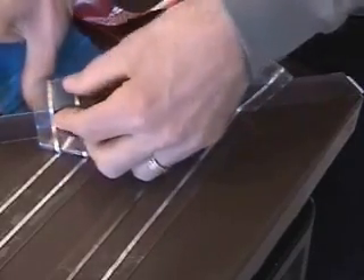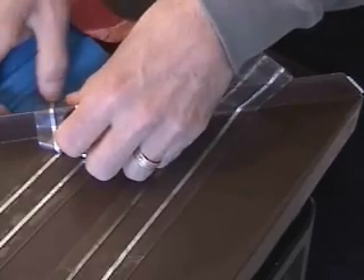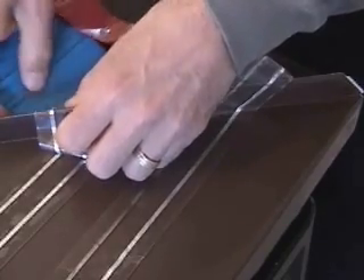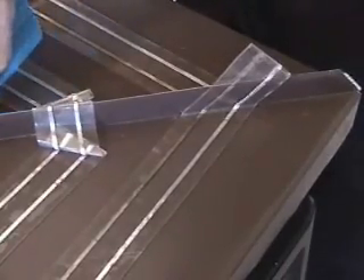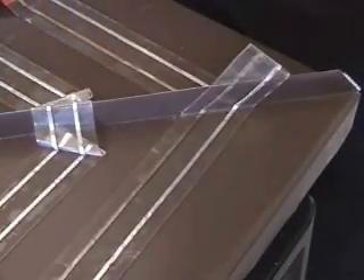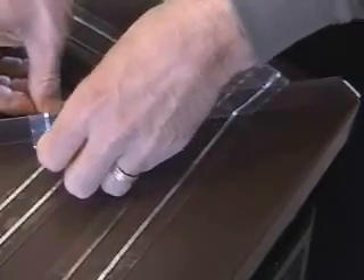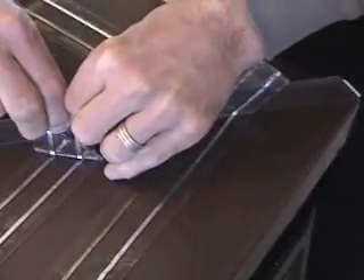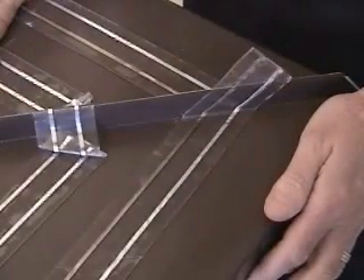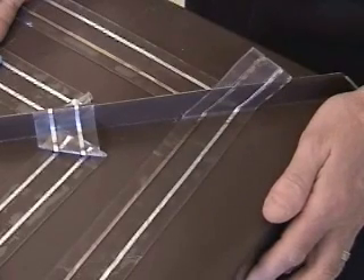Tack that in place, then once again come down through the center of the tape like this. Adjust your wires for positioning so they land on top of one another in a parallel fashion. Squeeze the top of the seam and there you have a low profile standing seam corner without a connector.